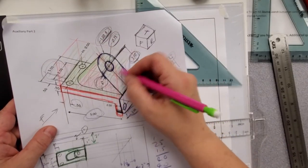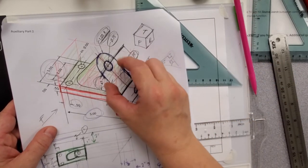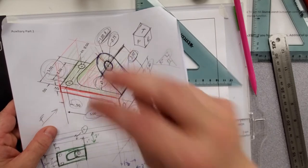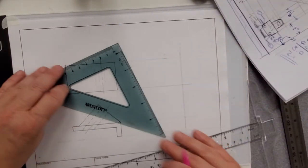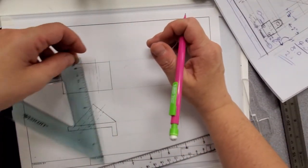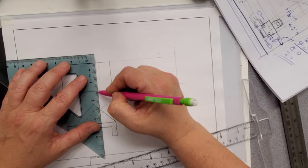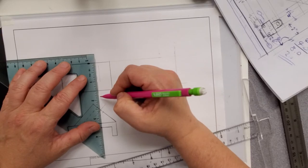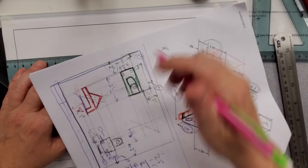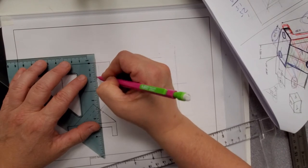If it's 1 inch radius, how wide is it? If it's a radius of 1 inch, it's a 2 inch width. And half of 2 is 1. But we want it centered, so that this thing is 1.5 already. So what's the halfway mark of 1.5 inches? 1.5 divided by 2. Yes, because when you break it down, that's how you get it. Yep. So you go to the 3/4.